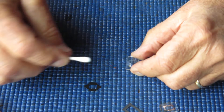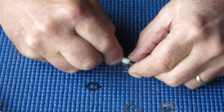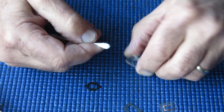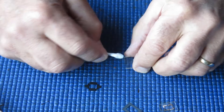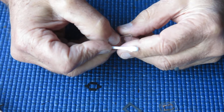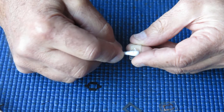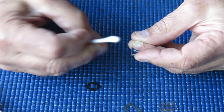Now I'll start with the other components — beginning with this glass lens from the front. It's quite hazy. The haze is probably oil droplet haze from the camera having been stored somewhere where the volatile components of the oils and greases vaporized and then settled on the glass because it's a convenient surface.